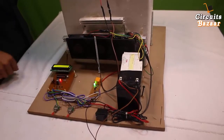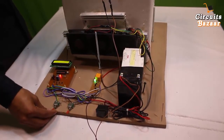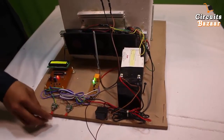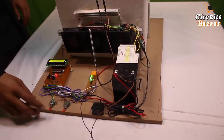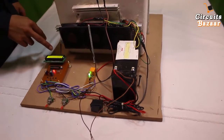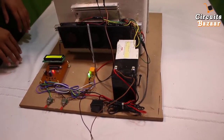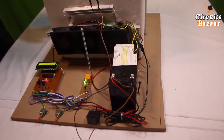The relay is on, which is why this LED is on. Now temperature has become 24.9 degrees. If you take the button in this direction, that is manual mode — it will not take feedback and will keep on decreasing the temperature. In the other direction, it will take feedback from the circuit. After 24 degrees, whenever the temperature becomes around 23.90, the relay will immediately cut down because that is the threshold temperature we need in the box.